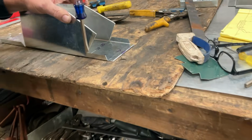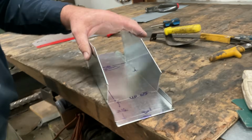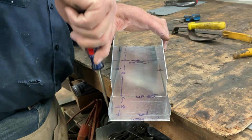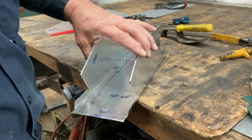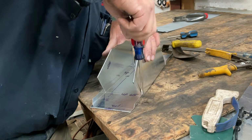do this over a table. All I'm doing is twisting. I'm just twisting, no pushing. So can any of you out there tell me what's wrong with doing this out here? If my screwdriver comes out, I end up in a bad place, and now I'm looking for where they keep the Band-Aids. So always over a bench, over a table, or over the floor.